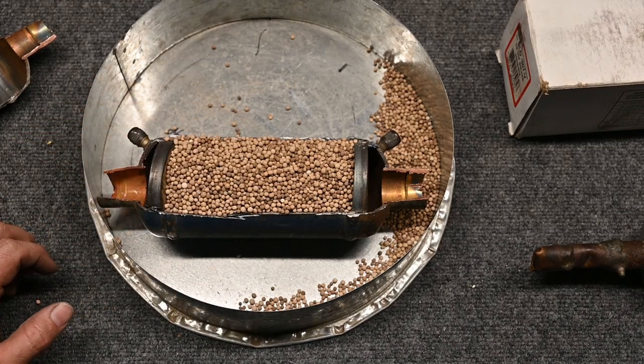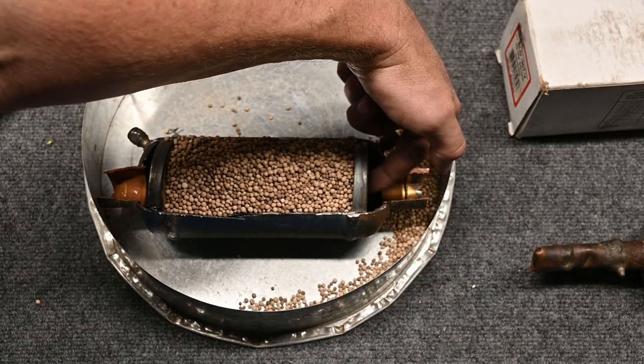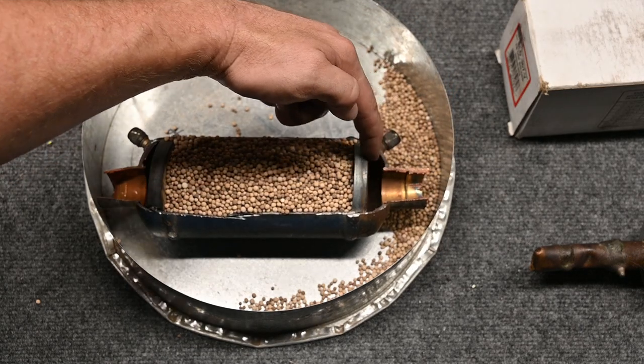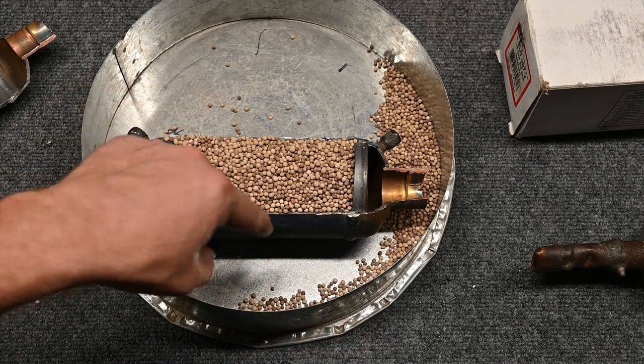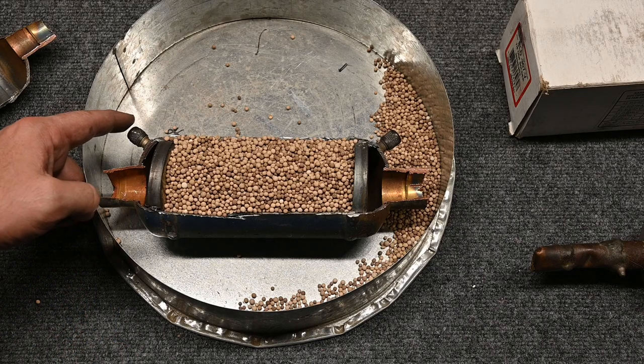There are different types of BBs used for the tube. On the desiccant side there's a flat disc here so the refrigerant can't go anywhere — it goes up to the edge, and the very edge is perforated with a lot of little holes. The refrigerant comes through this desiccant material to the inside tube, and then from the inside tube it carries on to the other side where we can measure the pressure.